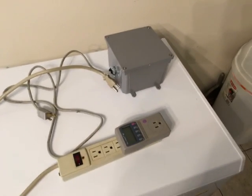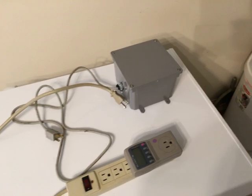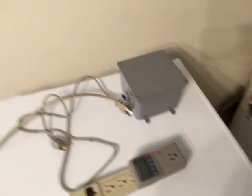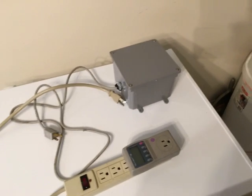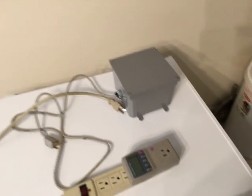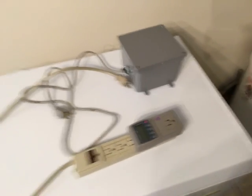As a public service to the community: these power-saving devices — no, they don't work. It could work if there were a way to only turn it on when the compressor kicks on, done through relays, but with my capacitor bank this is a moot point anyway. I had just left it plugged in thinking I was saving energy, but no. This is an AC run capacitor, and as Philip explained, it's switching — charging and discharging 60 times a second, once per cycle — and that takes energy.